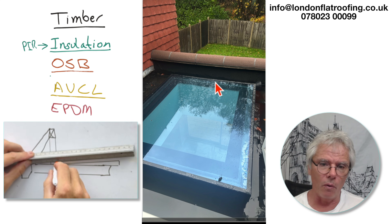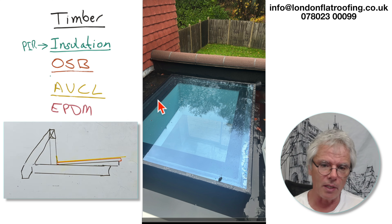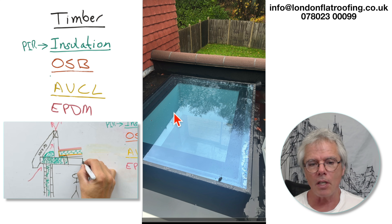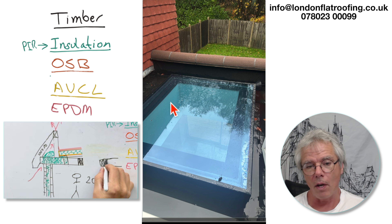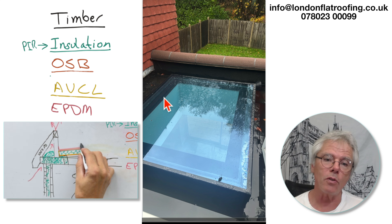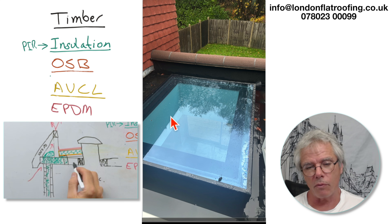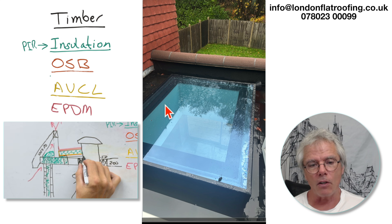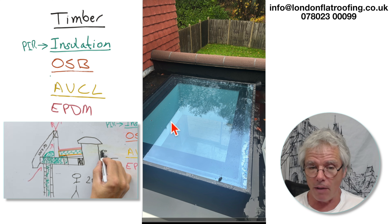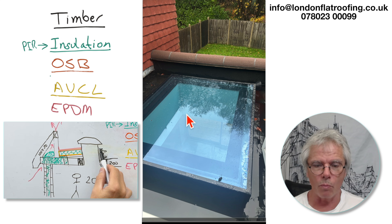I would suggest 200mm because it's taking all the weight of this ridge area and all the tiles, so there's a lot of weight bearing on that, plus the skylight. So you'll have double trimmers on each side, giving us probably 200mm timbers. Depending on when this was done, you might have 120 to 150mm of insulation, plus furrings on top, plus OSB, and at the bottom you've got plasterboard. So: 200mm timbers + 150mm insulation = 350mm, plus about 25mm furring, plus the top layer — you're looking at about 420mm total. If you haven't got around 420mm, you'd start to question whether this is a proper warm roof build-up.